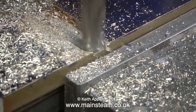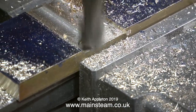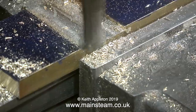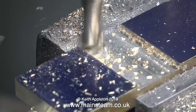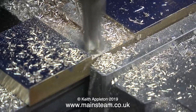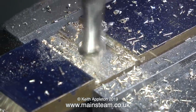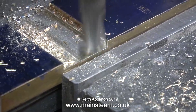This is a new milling cutter so it's very sharp indeed. You will also notice that I'm trying to cut against the brass all the time, although I can do it the other way around — this milling machine is rigid enough to do that. The last part of the job is to use the milling cutter up against the scribed line. If you start on the scribed line you might get it wrong, so it's best to mill out the centre part and then go very carefully down the scribed lines. This footage is running at high speed and you will see that I keep putting a paintbrush in the image — this just brushes away the chips, otherwise I wouldn't be able to see what I was doing.